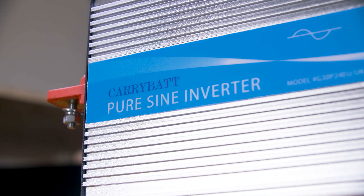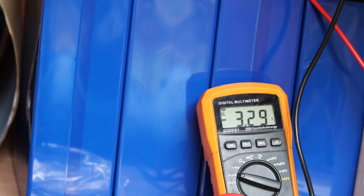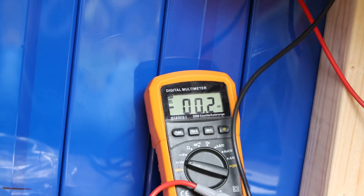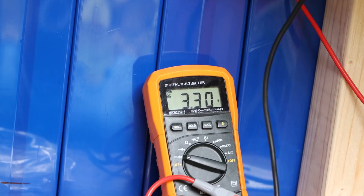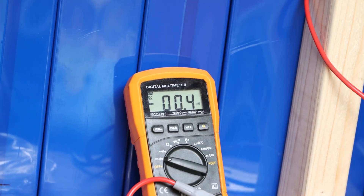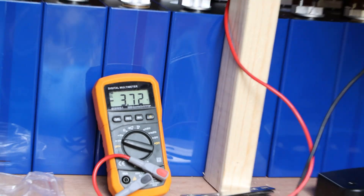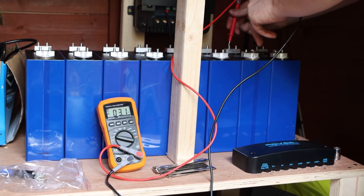The new one was another £300, and while I was in there, I also added a battery isolator switch and a pre-charge resistor, and I put the whole thing in an enclosed and partially insulated box, where especially in winter the inverter's heat output helps keep the batteries warm enough. I've spent maybe £500 on improvements over the years, which I'm well aware is the vast majority of the savings I've made.